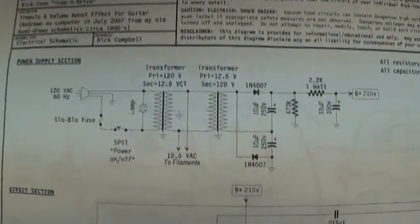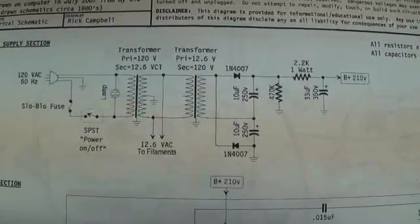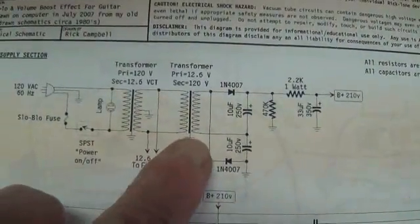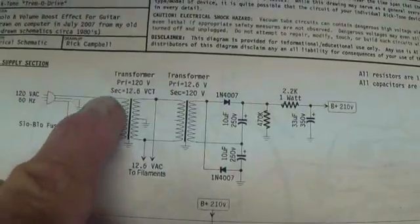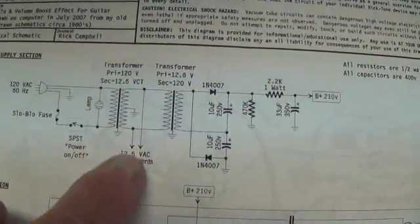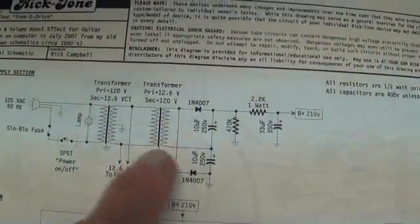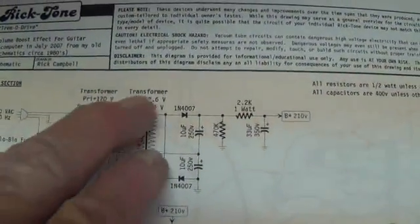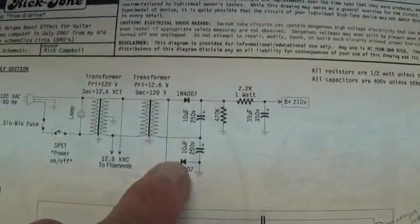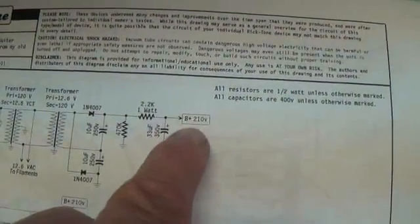Let me shift over to the Ricktone schematic. To me it was a major discovery, and to some people this might be of great interest. You use two small and very inexpensive transformers — I got these from Radio Shack, about $6 or $8 a piece. The first one takes the 120 volts AC and steps it down to 12.6 volts. We use that 12.6 for our filament voltage for the 12AX7. Then we reverse the second transformer and take the 12.6 volts from the first and step it back up to 120. We then use a voltage doubling arrangement of diodes and end up with about 230 or 240 volts for your B+.